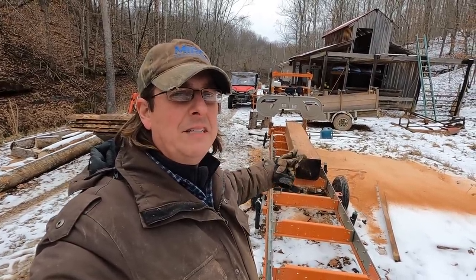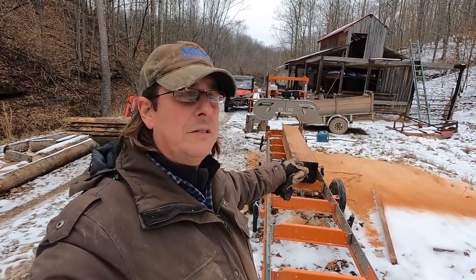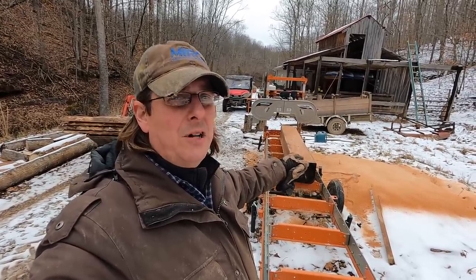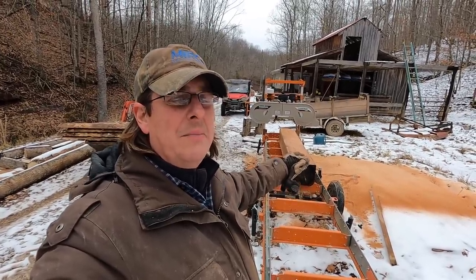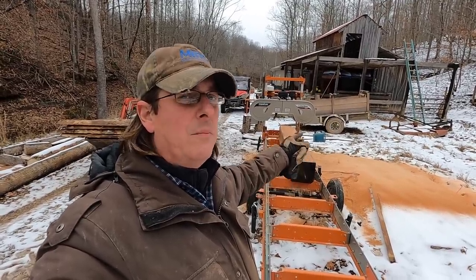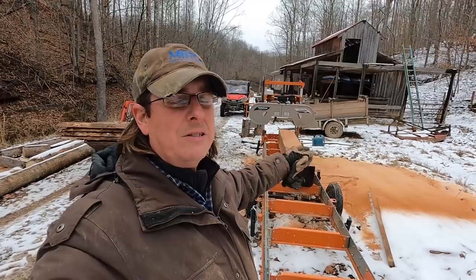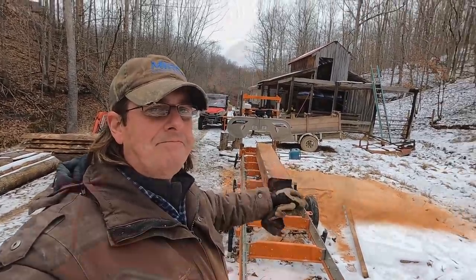And then I'm gonna cut 5 inches off that top and turn it 90 degrees because I wanna get some 5-inch wide boards, most of which are gonna be either rift or quarter sawn, which is a whole nother discussion, we'll get into that. But turning that 90 degrees, I'll have a couple flat sawn boards on the top and the bottom, but the rest will be rift and quarter sawn. So I really like the look of that.